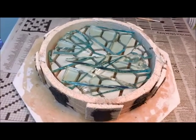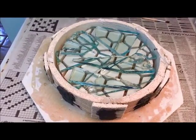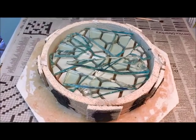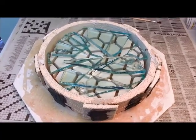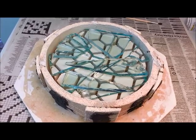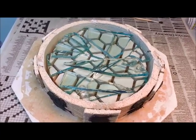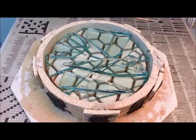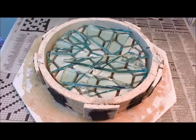If I've calculated correctly — and there's always an 'if' because sometimes I've spectacularly miscalculated — that is the correct amount of glass: three pounds, three ounces. It should fill the channels and leave a thin surface layer. I'm not trying to make a complete honeycomb mirror here. What I'm doing is casting the honeycomb back separately, then fusing a bubble-free sheet of glass on top of it. It may be a complete disaster or completely brilliant — there's no telling at this point.